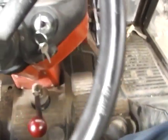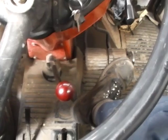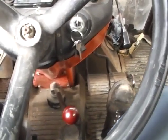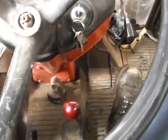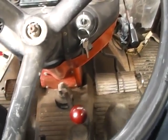I'll see it come down the side. Accelerator as normal. Got your brakes, which, as with nearly all tractors, you can unlatch and brake one wheel independently of the other. So if you were ploughing on the headland turn, you can unlatch as you lift the plough up. Obviously it lightens the front end, you can then brake and it will turn you around quicker.